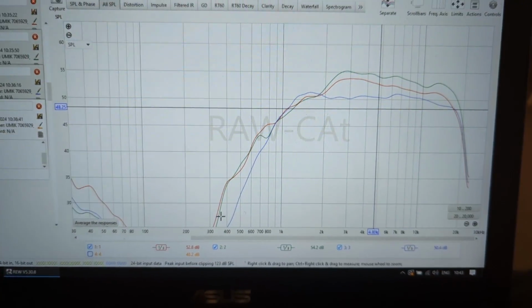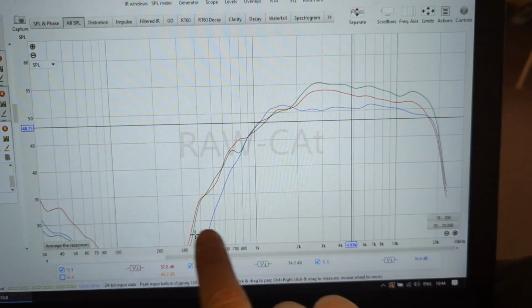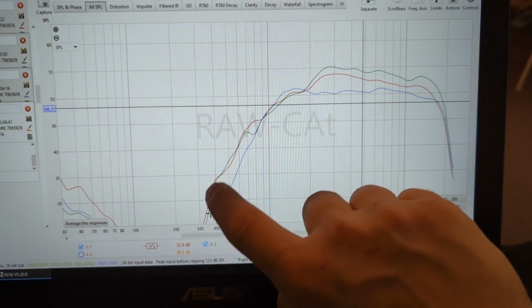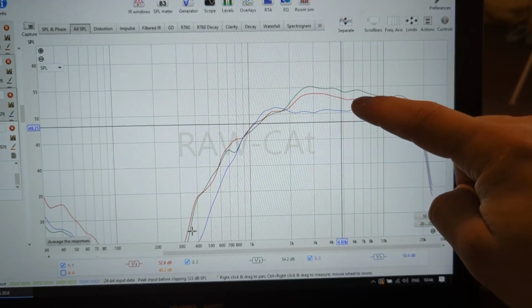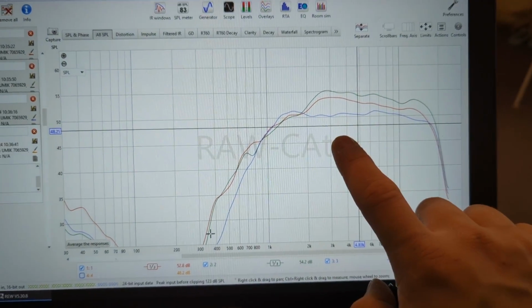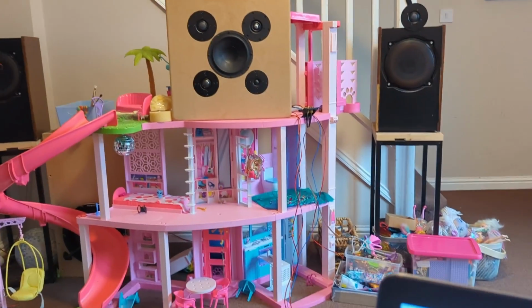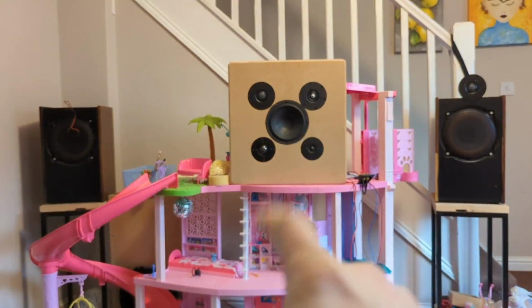If I'm just going to remove this, the only thing I really need to do is, this slope might influence the sound as well. So I might need to lower the crossover on the SB19 just to cover this, to make it a bit more the same as the others. And these levels, I just need to bring down either with a shelf filter or with a very wide EQ band, just bring it down to match it. But for this, I need to rearrange the wiring so that I could still use this flippy button that I have, but each would have to be on a separate amplifier channel.